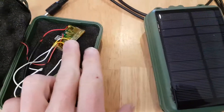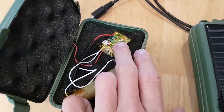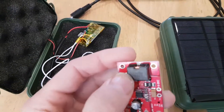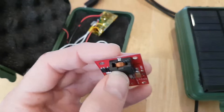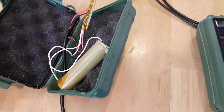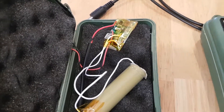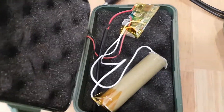The other thing is with these circuit boards, there are a couple of different technologies you can use with solar power: PWM and MPPT. Here's an MPPT solar controller — they'll have this coil or choke here. What it does is it converts the power from whatever the solar panel's output is, because it varies, and it steps it down to what you need the power to be. That's an MPPT. They're typically more expensive, but they're more efficient and make much better use of the power being created.